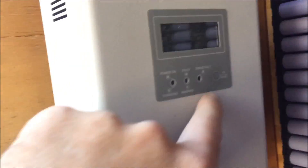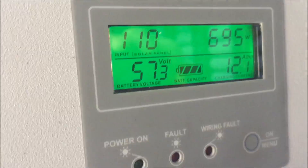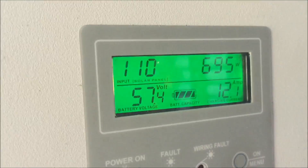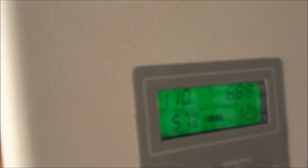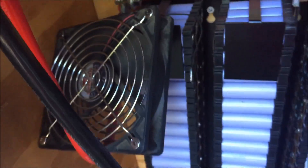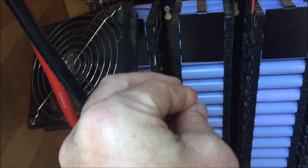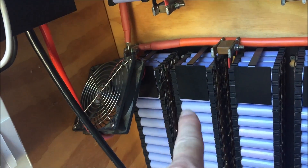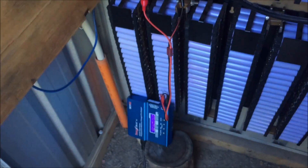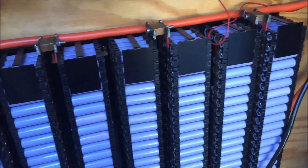I also had a fan running on these two packs cooling my PCM 60X. The batteries are at 57.3 volts so they're almost fully charged and the system is at 110 volts going into float mode. I had these two batteries on this fan for about two to three weeks and it drew those two banks down significantly lower than the rest, so I'm using my IMAX just to put a bit extra into both. It's manual balancing but it's how I've always done it.